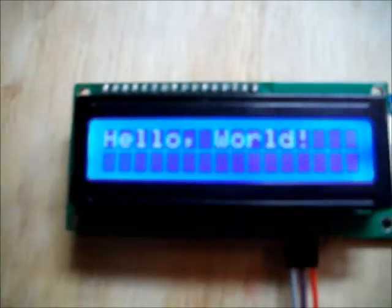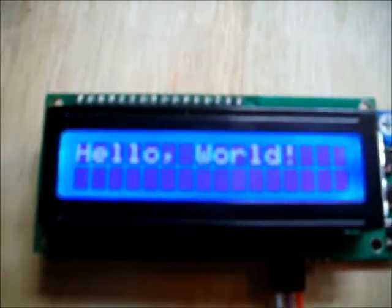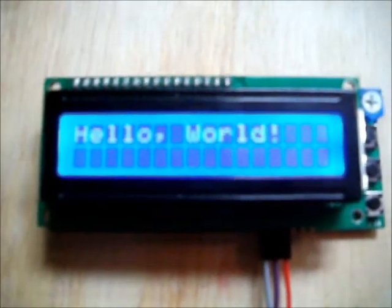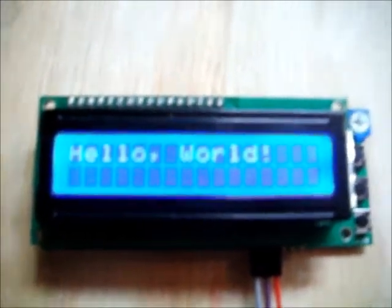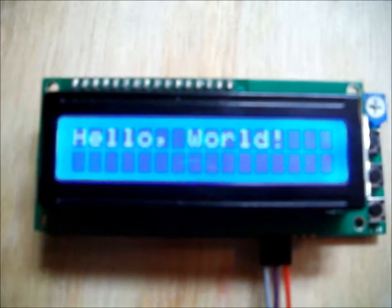Now you use a very simple set of different commands — you can't read that at all actually. Such as using the at symbol as used in email to send text, and using a hash symbol to send different commands. The hash commands are followed by a number and then any attributes that command has. Such as for the backlight you send 1 or 0 for turning it on and off. Hash 0 is a command for setting the X and Y position on the screen, then you send the X and Y position, and lastly you send a line feed character, also known as decimal character 10.